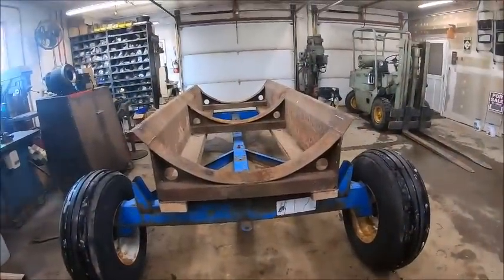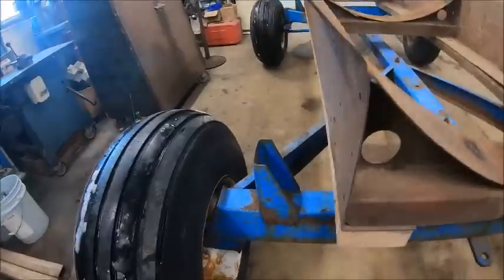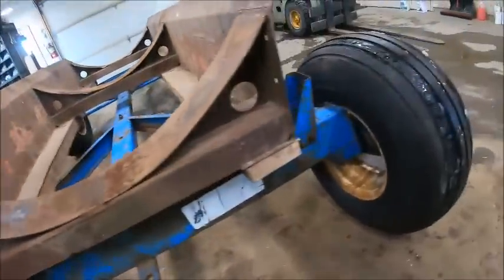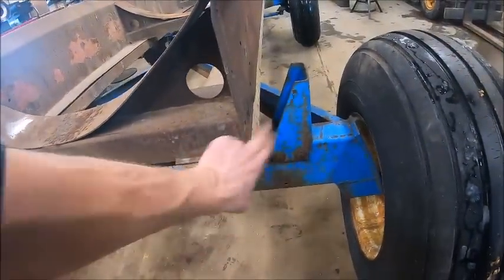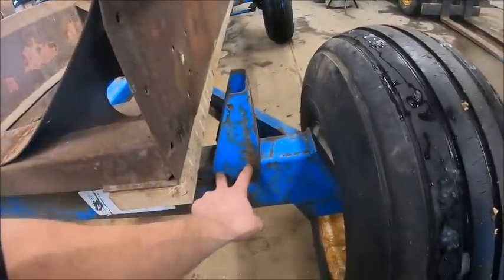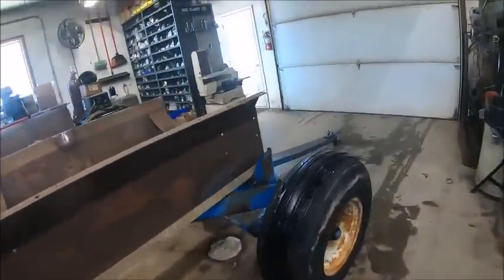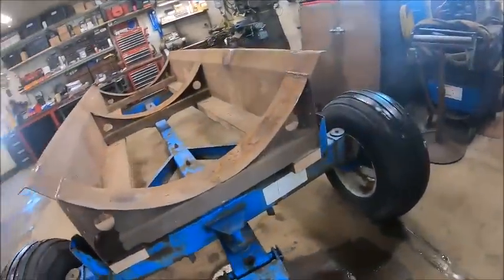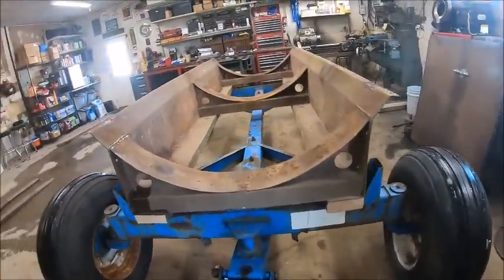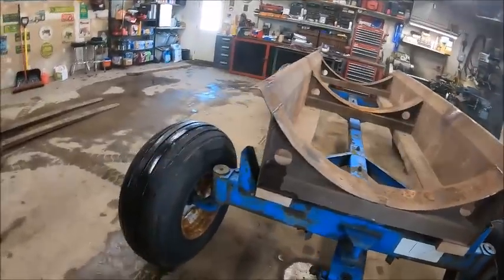All right, so we got the saddle sitting on the gear. It looks like if I move this guy to this set of holes, obviously flip it around, and that guy, I'd have to, the bolster needs to slide, or the saddle needs to slide over a little bit. It's not quite center, but take this guy, move him to this set of holes and flip it around, and then take the front ones and just flip them around from where they are at. It should pretty much be where it needs to be.